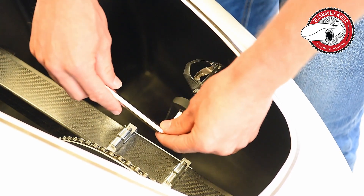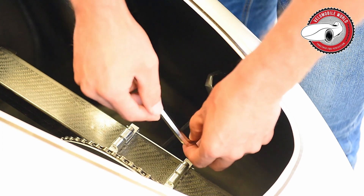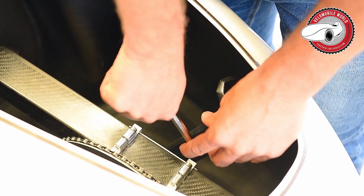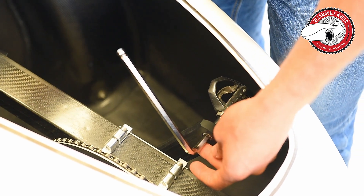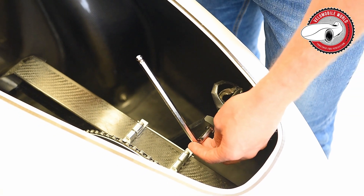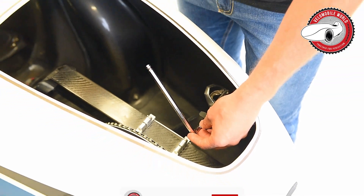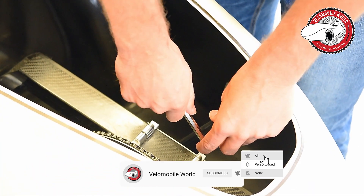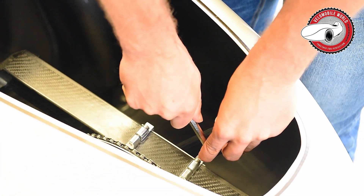The untightening direction is the other way around. For 10 Newton meters, think of it as a one-meter lever with about a kilogram of force — useful if you don't have a torque wrench.